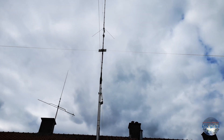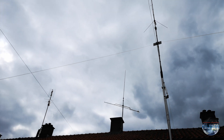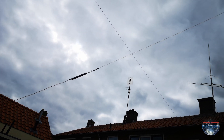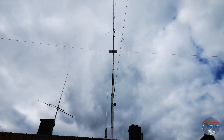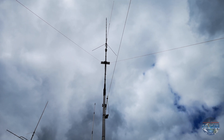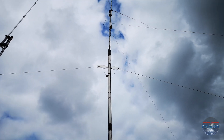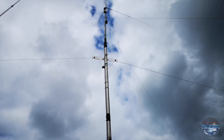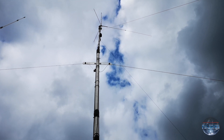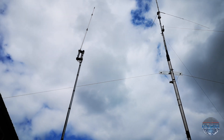This is the antenna. The feed point is 12 meters above the ground and that is the other wire with the insulator. And the other antenna here is my monoband dipole for 40 meters, 10 meters above the ground and goes here.